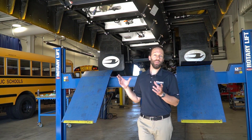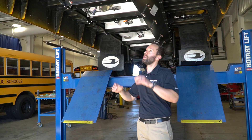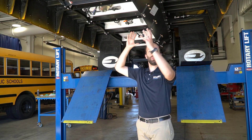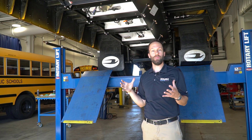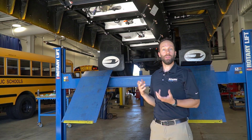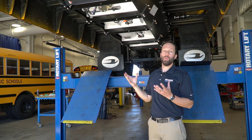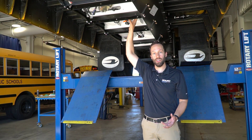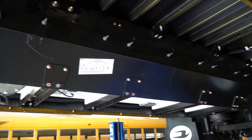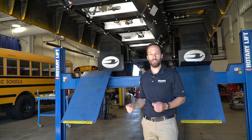All of those propane fuel tank components are mounted to an ASME rated fuel tank. This is a dual manifolded tank — two cylinders that are welded together with pass-throughs so it functions as one fuel tank. It comes in a few different sizes to meet different range needs for the bus, and it's also very well protected inside the chassis. Not only is the tank an eighth inch thick steel, but it's protected on the sides by large crash support barriers and meets the most stringent crash test standards.